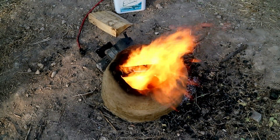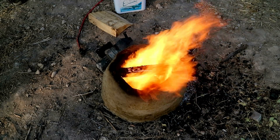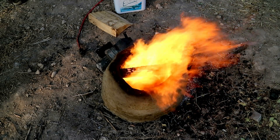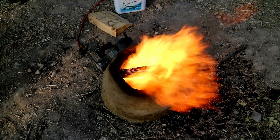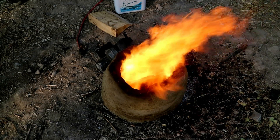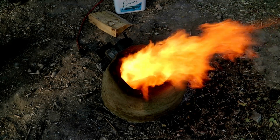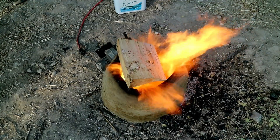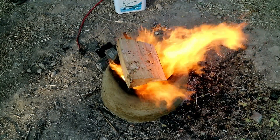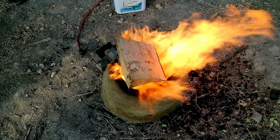This is the Aristotle hearth in action. It's also an illustration of heuristic number 637 for lighting and maintaining large fires for your backyard projects: if your fire isn't large enough or hot enough, you'll be tempted to just throw on more fuel. However, often the size and heat of your fire is bottlenecked not by the amount of fuel, but by the amount of airflow. So before you throw on another load of charcoal, try hooking up a fan.